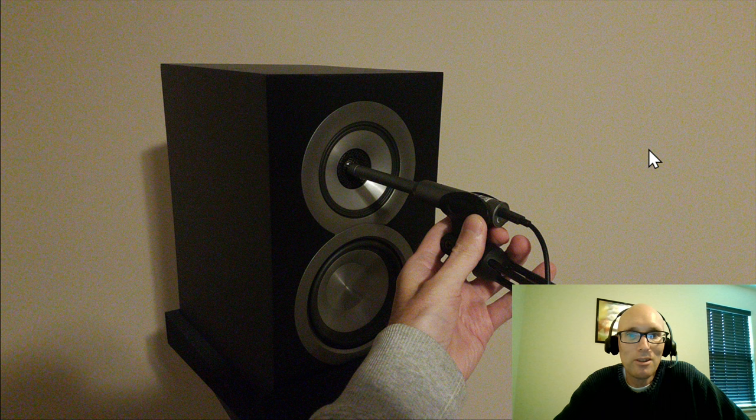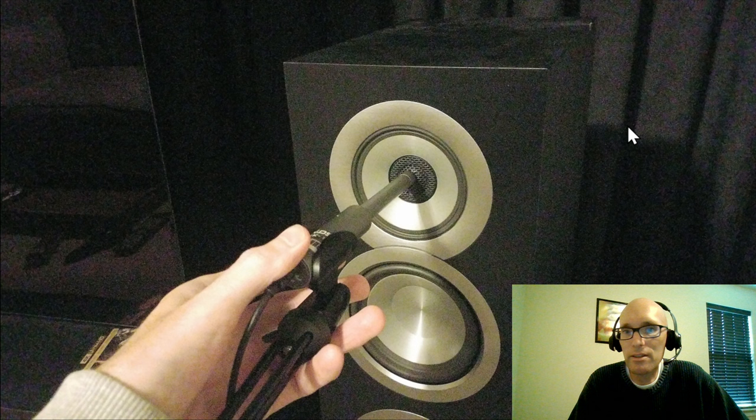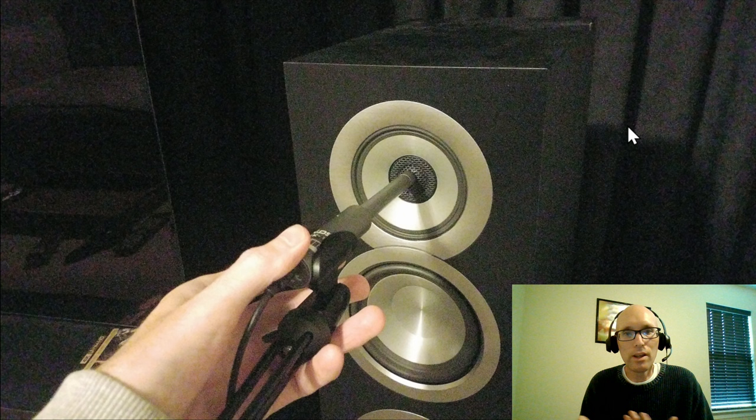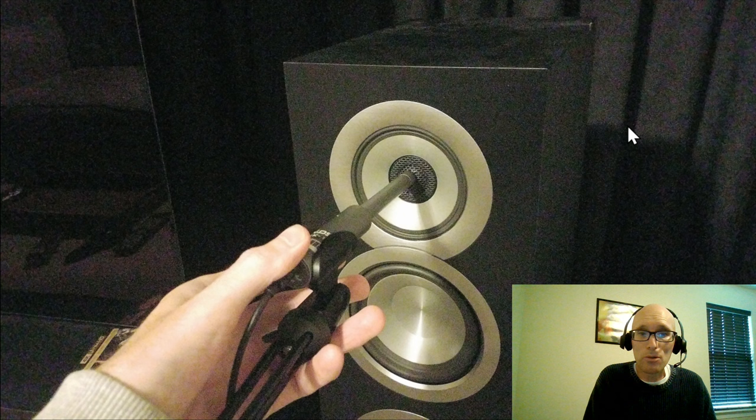What is the goal here? The goal here is absolute near field, measure 75 dB each channel, right? So I did this to every single channel. Obviously, before this, I need to back up a little. The trims on your input should be zero, and the test tones on the receiver should be zero, because there's